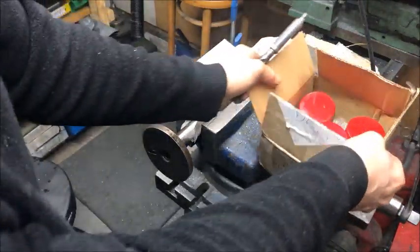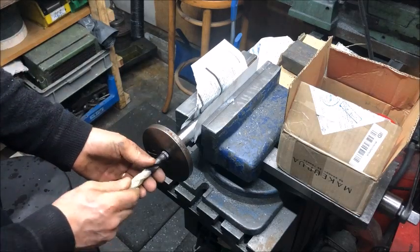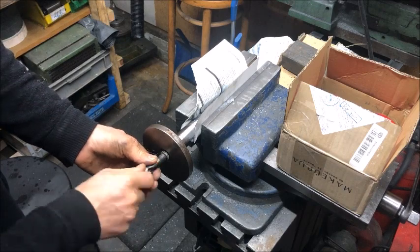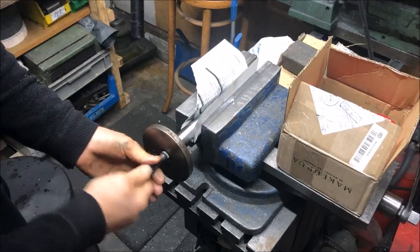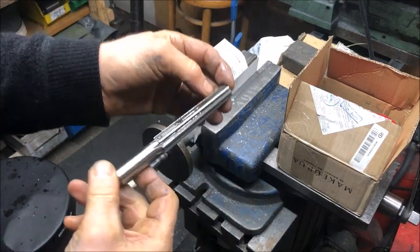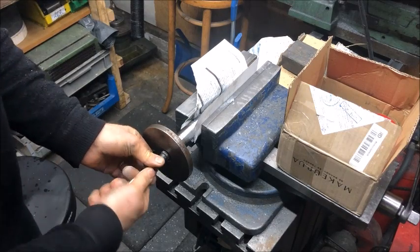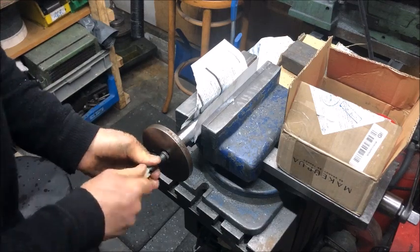Altogether there's a set of five, quite cheap. I at least think I won't do any damage, because some of these spindles are quite worn. I'm trying to just lap them into a little bit improved condition, so I don't have the marks on the inside. And of course I've used a reamer first to take off the high spots. We'll test them afterwards to see the fit and finish with a test bar.